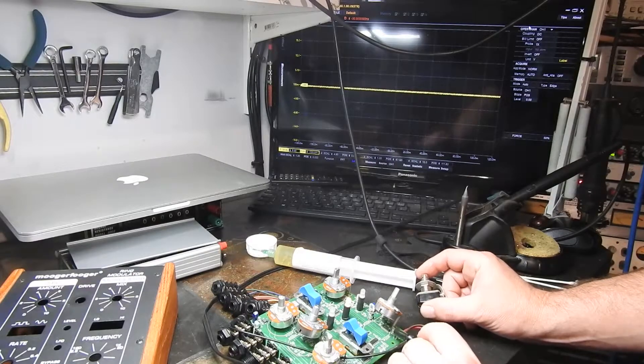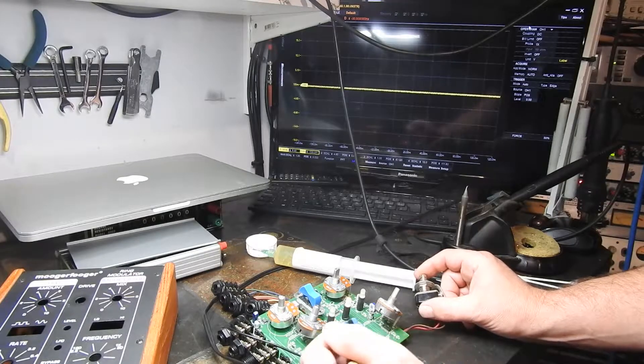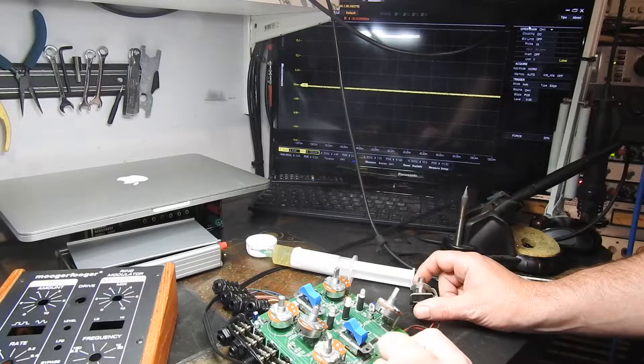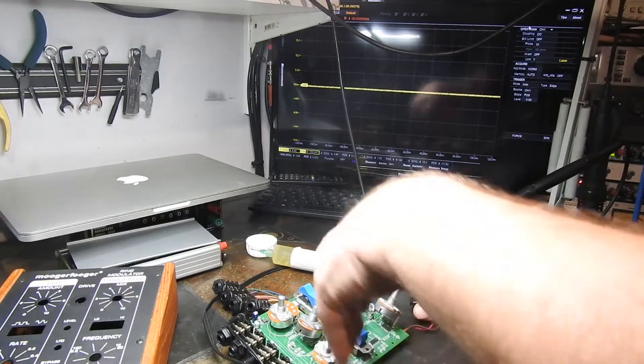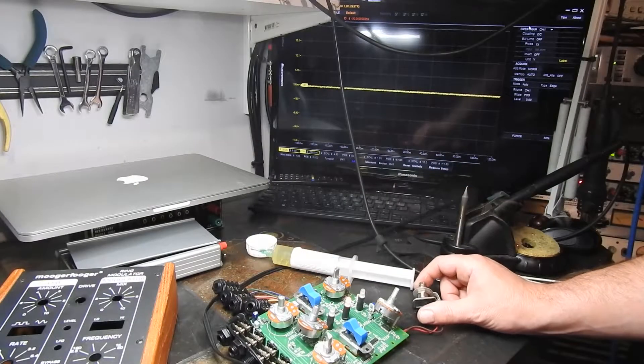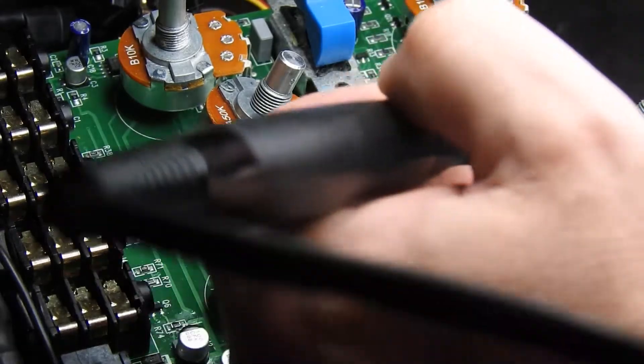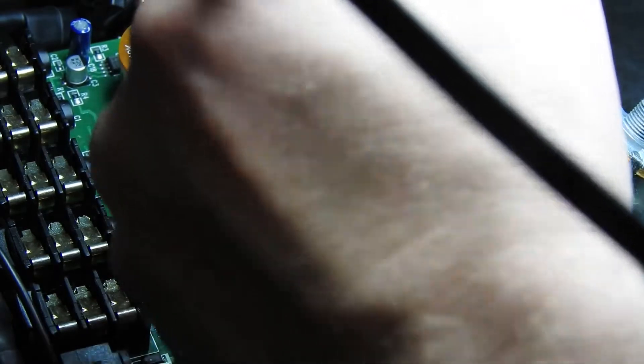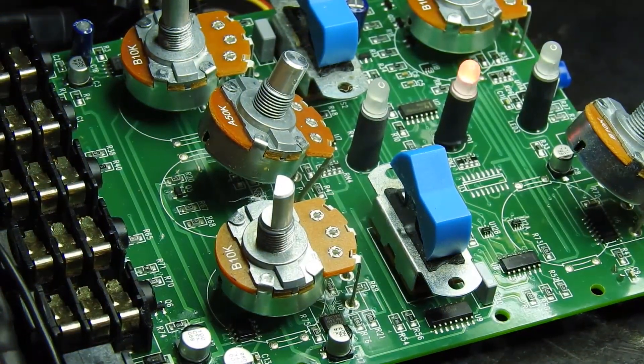The 4024 is working correctly. We should try putting that resistor back and see if it actually engages the rest of the circuit. That's the great thing about SMD resistors — it's so easy to just pop them in and out of circuit like this.